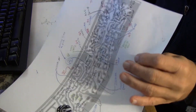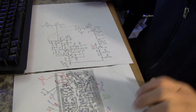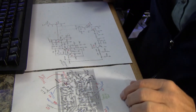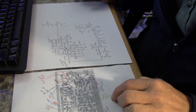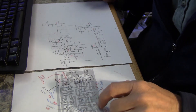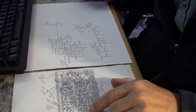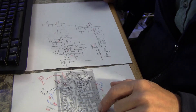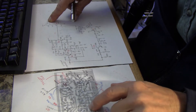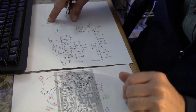Here I am transferring the board layout information to a schematic — this is a real hair-puller. Q4 is located here. His emitter goes up to 12 volts through a 220-ohm and a 1.5k resistor. The 1.5k has 47 microfarads in parallel. The signal continues from the collector to the base of Q5.